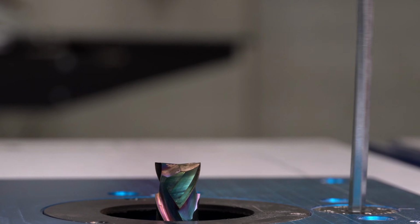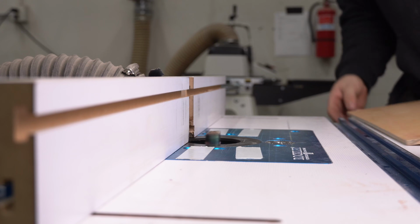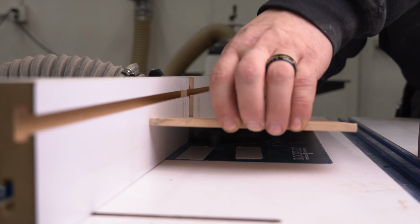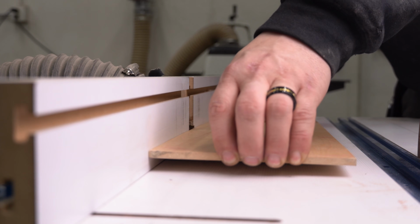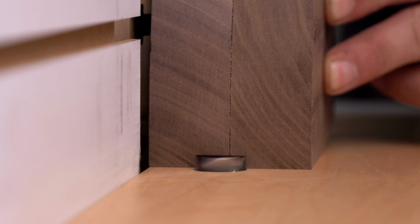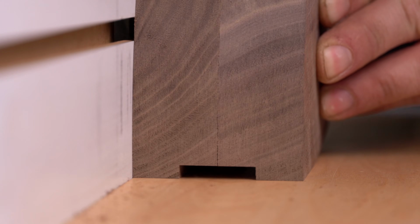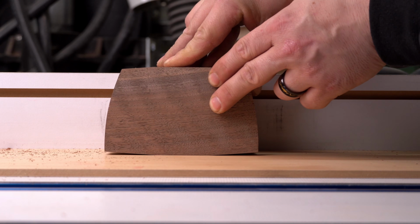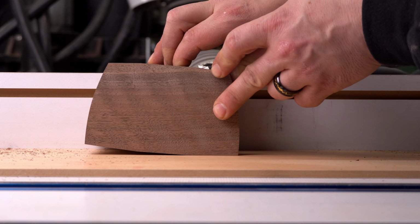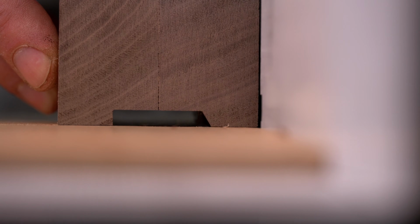But I don't want my mallet dipping into the router table because I don't have a zero clearance for this size of router bit. So I'm making an exact fitting one by just overlaying a 1/4 inch piece of plywood. This groove kind of has a purpose, but it's mainly for looks. And square edges would be just fine, but if I chamfer those edges, then they'll match a lot of the other patterning that's happening, while also letting the light fall over the edges a lot more softly.